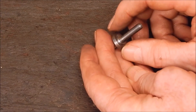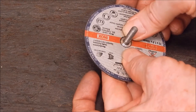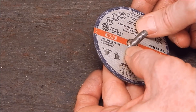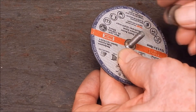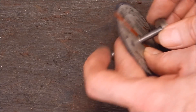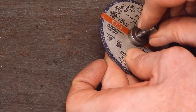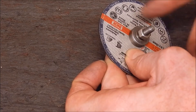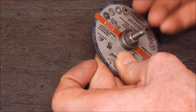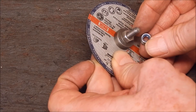On the side I've just stepped it out so you can see how it locates in the centre of the disc — that's your 10mm arbor, your 6mm bolt-on shaft — keeping the size of the thing right down to minimum. Then all we've got is a washer to go on the outside with a recessed centre that pulls up on the outside edge, the same diameter as the bit on the back. On goes your nut — I like to use a nylon lock nut just to be safe. I don't like spring washers because the split type tend to cant things by the nature of how they apply pressure, so a nylon lock nut is better.